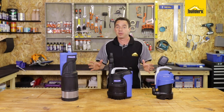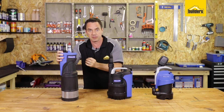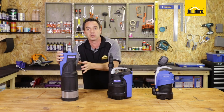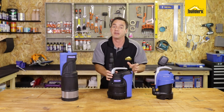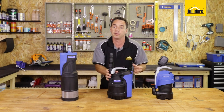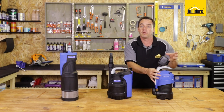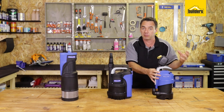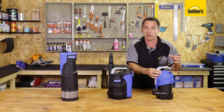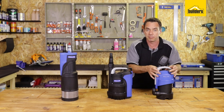In summary: the D-sub-1200 is ideal for high volume and high pressure — use it in your home, for irrigation systems, or inside a Jojo tank. The clean water pump is ideal for high volume at low pressure, perfect for emptying pools and ponds where water is clean. The dirty water pump handles particle sizes up to 32–38 millimeters and is ideal for flood areas and storm damage areas where there's heavy contamination and you need to protect your pump.